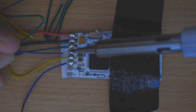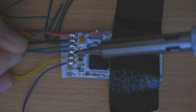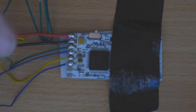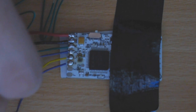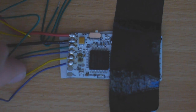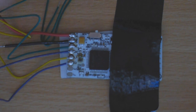So it comes with your Coolrunner wires, a spare blue one that you're not going to be using. So I'm going to solder that to B because it needs to go to the back of the motherboard. So that's all our points prepped. So we've got our 3 volt, we've got our ground, we've got our PLL bypass, our standby CLK 48 megahertz. This point is the one I'm using the alternative point on the back of the motherboard for. Then we've got our post out and our CPU reset, which I'm also using a normal wire for instead of the shielded cable.